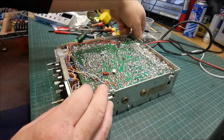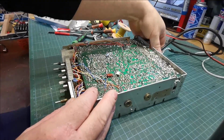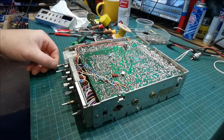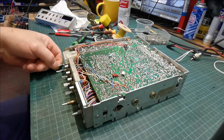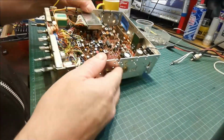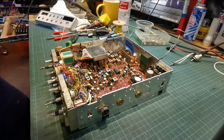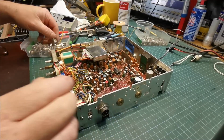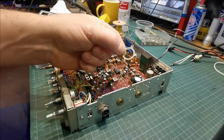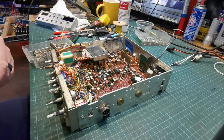Right, so we want to turn the radio off and disconnect everything. And then what I always like to do is actually turn it back on again, just to discharge the capacitors and all that. So, first thing we're going to do, there's no tab on that, that's one reason. So what I'm seeing there now is the SO239, it has no tab, one of these lads, for the ground to go onto, and you can't solder, it won't take properly unless you start grinding it.